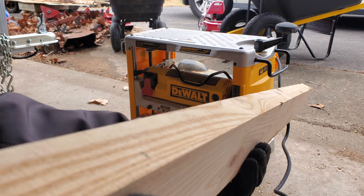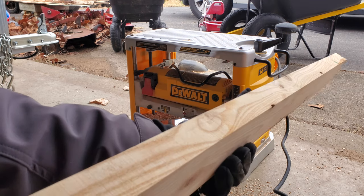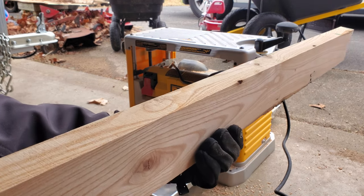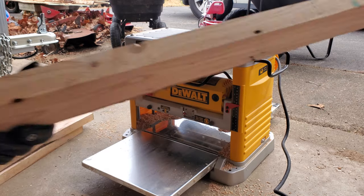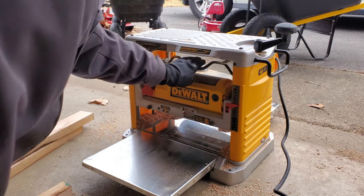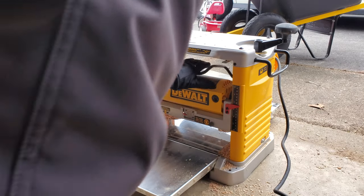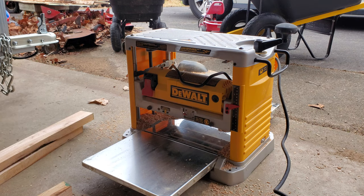It was close enough to pull it through but didn't actually make any cut, so I'm going to lower it by another two sixteenths of an inch — that's two turns. So unlock the saw head, two turns, lock the saw head back, and now we'll send it through again.